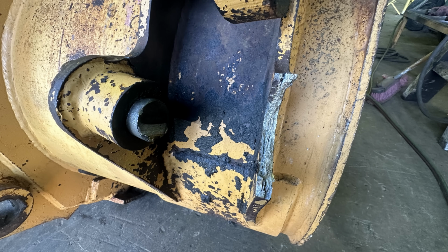So you can see how poor that base material is. It's more or less cracked and shattered all the way through. Over the years, I've gotten in arguments with people where a lot of people just take the approach, well, just grind that down with an angle grinder and reattach what broke off. The truth is the material is so fatigued and stress cracked that doing that isn't likely going to give you a lasting repair. So you're going to find that I just torch cut back far enough to where I know I'm in clean material that isn't fatigued.